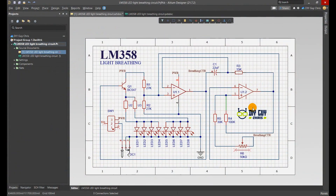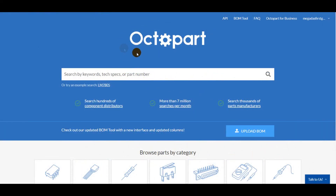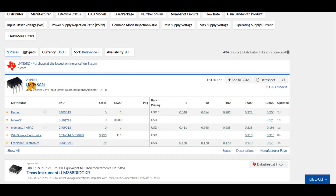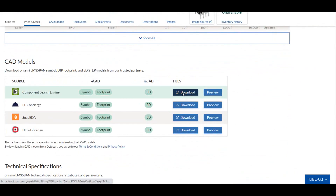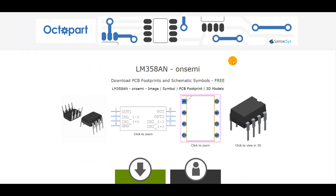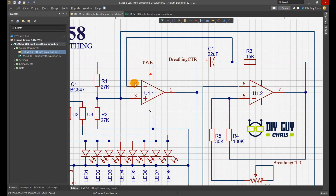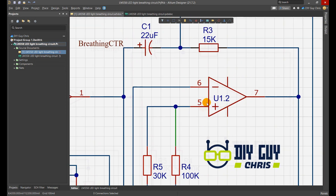I moved to Altium Designer to prepare the circuit schematic for this project, and as always I refer to Octopart in case I need some specific ECAD files for the needed components. Plenty of electronics parts are available there and you can simply search by manufacturer part number, then easily bring their ECAD files into Altium. Since our integrated circuit integrates dual amplifiers, I got them both separately displayed to help with the schematic nets connection.